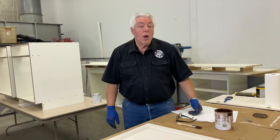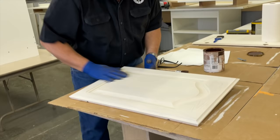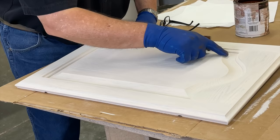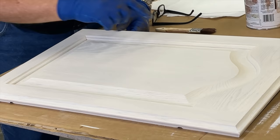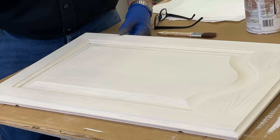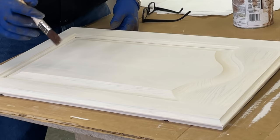We have our cabinet glazed now. We're getting ready to glaze the door. I wanted to point out one thing. In our original video, I sanded the door after I had put the primer on. But I sanded so hard that I brought this edge back down to the original golden oak. When I sanded this one, the same thing happened. You have to be careful. I went back and did a little touch-up before we got to this point and retouched up my sand so that I can make sure I don't have that raw edge wood showing, that golden oak edge showing through. Something to keep in mind, the mistake I made the first time that I corrected this time. But let's go ahead. I'm just going to go through and glaze this door, and then we're going to be ready to move on.